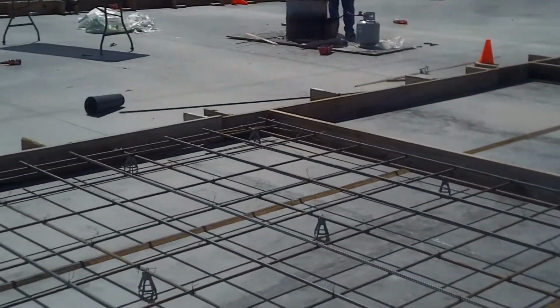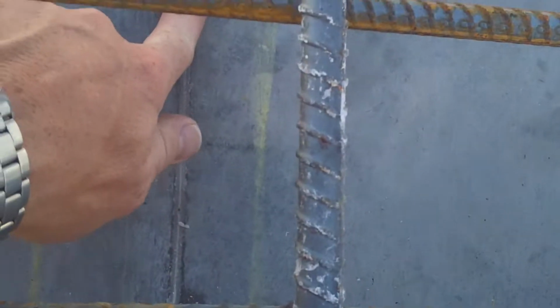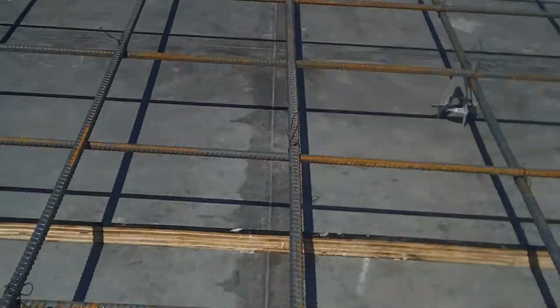Another application going on with the tilt panel contractor RA Libs is the use of paraffin. Now what we do here to maintain a smooth looking panel is these floors have saw cuts. And that saw cut right there, if we left it and poured the concrete panels, you would have that mimic throughout the panels, and you'd be grinding them off and you would see it everywhere. And since these floors are extremely smooth and flat, what we do is we come back through right here and we pour these saw cut joints full of paraffin wax. That paraffin wax shaves off, and then that joint is filled. We'll spray another application of bond breaker on it, and it'll stay in there forever.